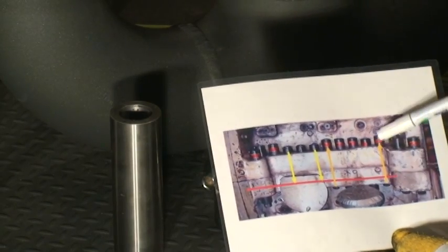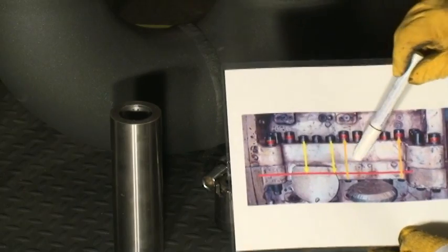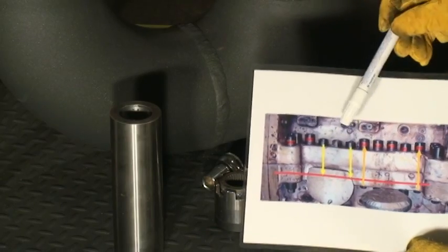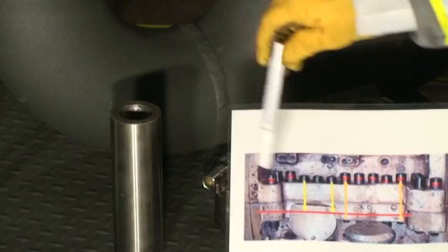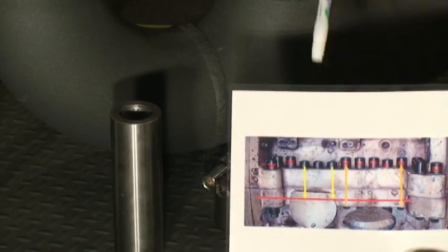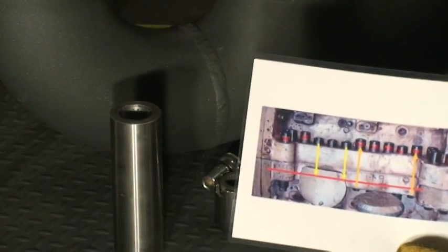On the other side, here's a good example of our standard clamps we looked at earlier, showing the through bolt coming up with standard clamps. These three bolts here are screwed into the housing — that gives you an idea of what our little simulator is going to demonstrate. The smart stud simply screws into the housing, and because of the mechanics and design, when tightening the bolt it has no chance of going down and mushrooming out inside the housing. The bolt itself wants to pull out away from the hole, and our customers really appreciate that.